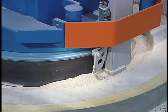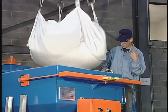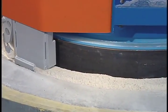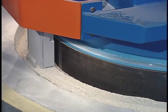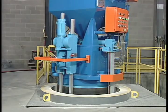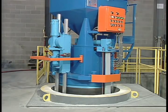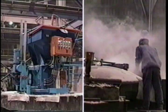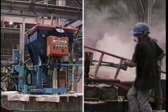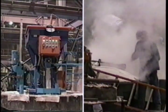We found that the more even material distribution and uninterrupted forking required additional material in the lining process. But this meant we were getting a substantially denser lining and increased furnace lining life. The consistency also meant that furnaces were being lined the same way every time, for predictable production schedules. The dramatic reduction in hazardous airborne dust is visible when comparing a furnace lined with the installation system to manual lining.